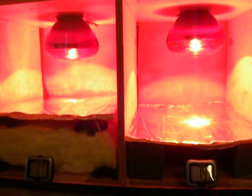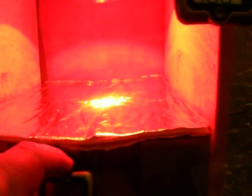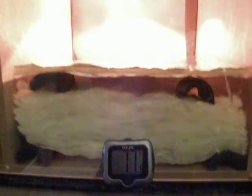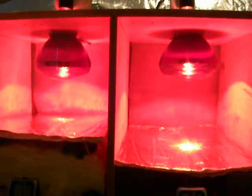Let's see how our thermostats are doing. We are currently at 167 degrees on the upper thermostat — I think that just rolled to 168. We are at 79 degrees on the lower thermostat, the one under the Solar Guard used by itself. And we've got a couple of degrees better on the Solar Guard used in conjunction with the fiberglass. So as you can see, this material is doing an exceptional job of reflecting that radiant heat.